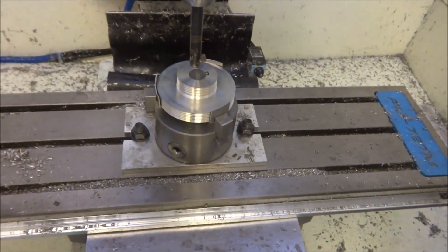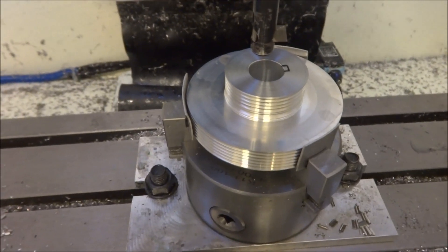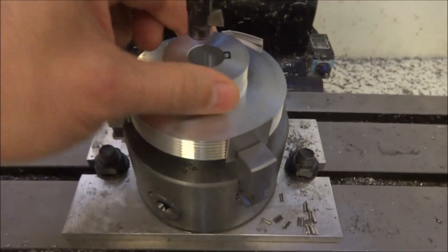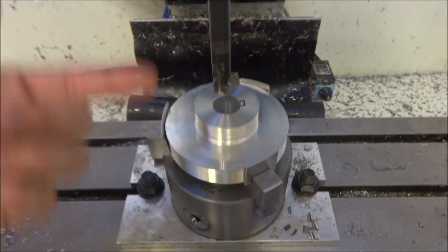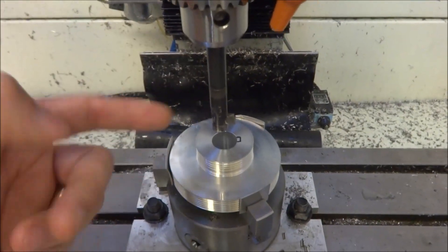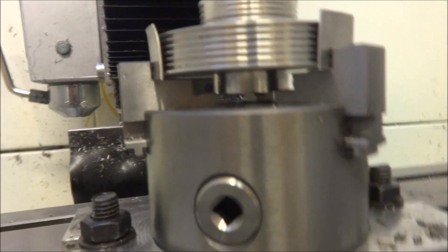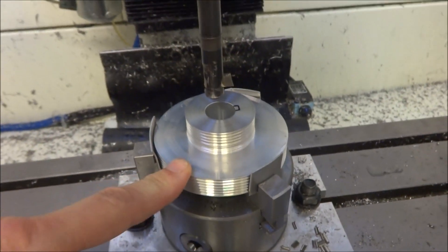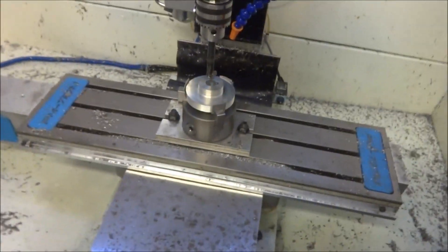It's always a little tricky and scary when you're doing this on the actual part. I've already got a lot of machining time on this particular part, so messing it up now would be devastating. That's just the way it goes when you're doing things for the first time. So what I did was I had to handwrite some code — basically I'm just going to be plunging down the z-axis and then moving in the positive x direction a thousandths each pass until we get to the desired depth, which is about an eighth of an inch. I've got it held in a three-jaw chuck, raised up from the bottom a little, and the hole in the chuck will allow the tool to go down below the bottom of the pulley. So let's give it a shot and hopefully everything will turn out just right.